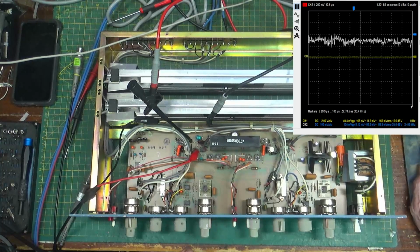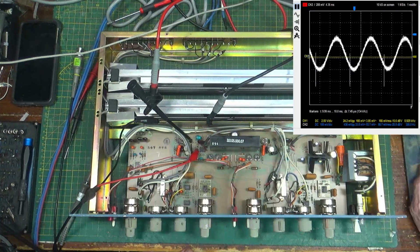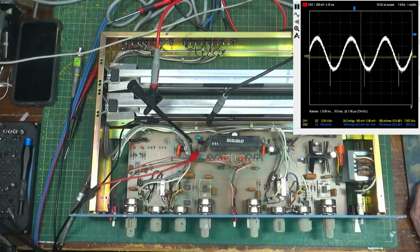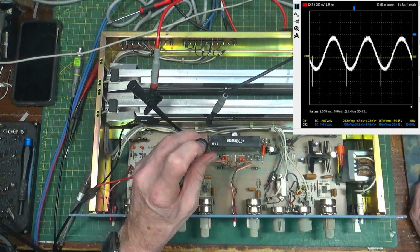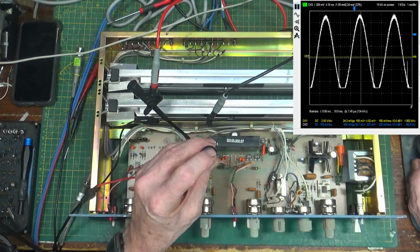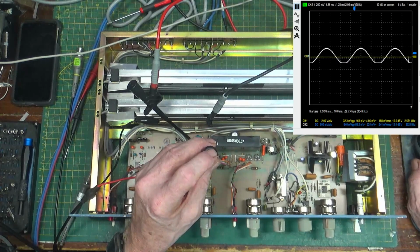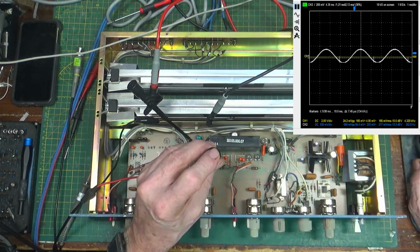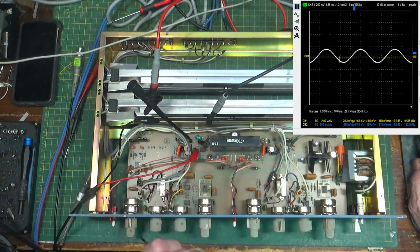I'm going to change my speed here so we can read it. All right. And slowly rotate R183 clockwise until the level at TP1 stops rising. Okay. The level at TP1 stops rising. I bring my voltage down. Okay, we're going to do it right about there. So that stopped rising. Increase the oscillator output to 0 again. All right.